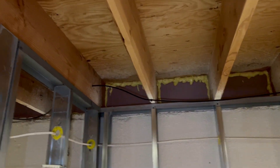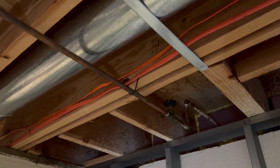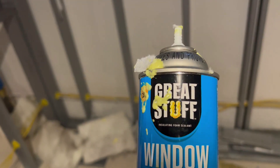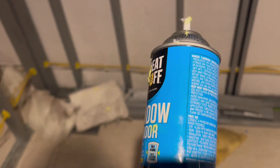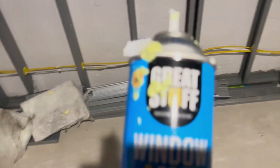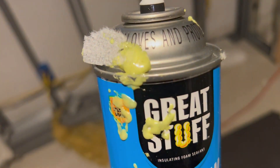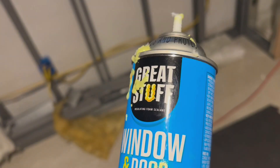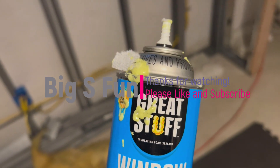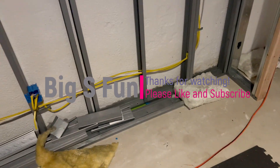Thanks for watching. I know it's kind of a long video but it's a good project. Just know you're not going to be able to do this on every rim joist — there will be situations where you just have to pack insulation back in. But if you can get 80 to 90 percent of them done with foam board and spray foam, that's better than nothing — better than it was before. Nothing in life is 100 percent. Have a great day, leave a comment and a like if you liked the video, and we'll talk later!